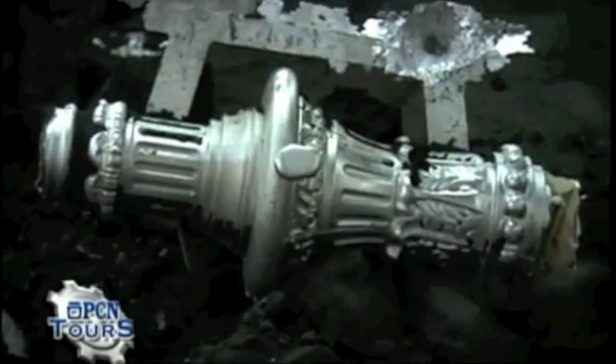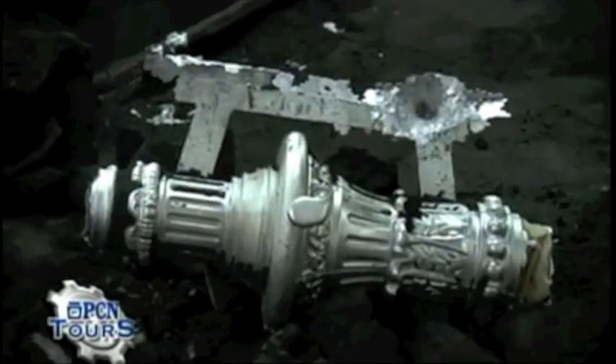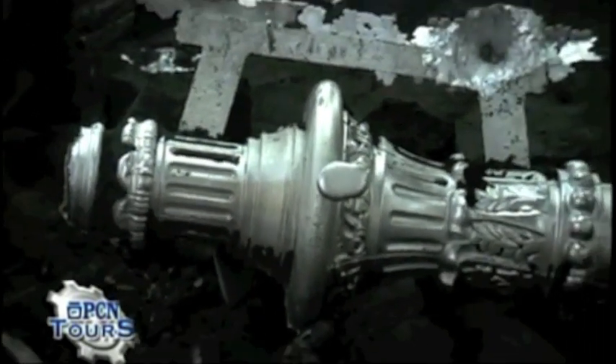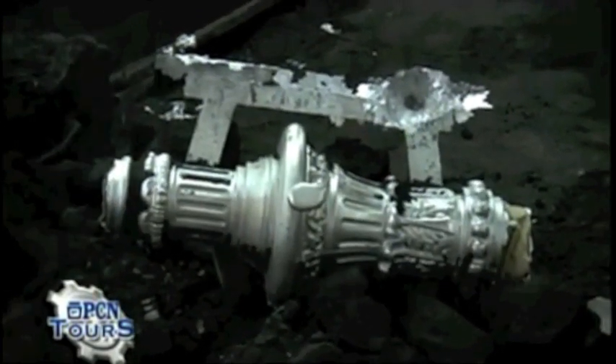You can see the gating — the non-decorative portion off the side — that's where it was poured into the mold. Spring City is noted for its detail and ornamentation, and the Bishop's Crook setup is a great example of the detail we can achieve. You can also see how quickly aluminum solidifies. We poured these no more than 20 minutes ago and they're already in a solid state — still hot, probably around 600 to 700 degrees, but cool to the touch in the next 30 minutes to an hour.